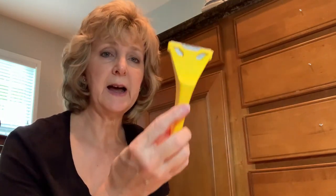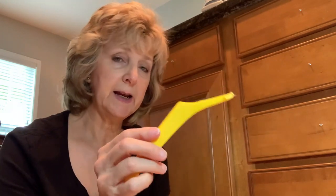Along with the cleaning process, if you're doing kitchen or bathroom cabinetry, get these scrubby pads. They help knock off any grease or food gunk in your kitchen, or hairspray and other products in your bathroom that can gunk up your cabinetry and affect paint adhesion. I also like to have soft rags on hand. Not necessary but handy — one of these little razor blades, which I use to pop off the little bumpers on your cabinets and scrape off the paper backing underneath.